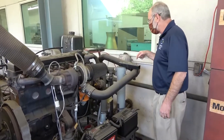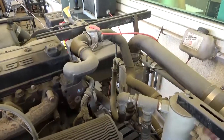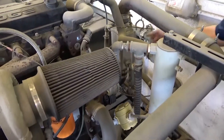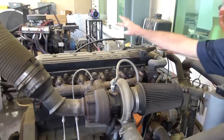So the compressed air is now going to go into this, which is our intercooler. The compressed air moves through cooling water from the building's cooling water system, which cools that air down. And then the cooled air is going to come into the engine on the other side here, to the air intake.